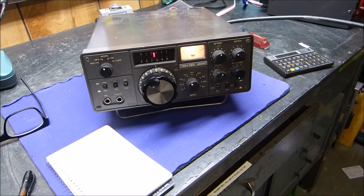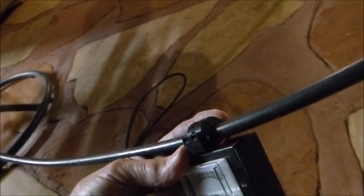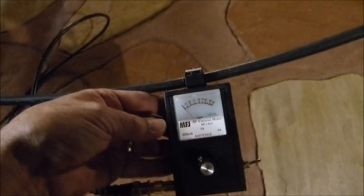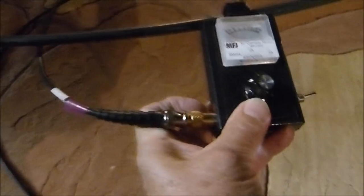I'm going to use this little Ten-Tec Argosy so I can generate just a little bit of RF. I've got some coax strung out here, marked off in meters. I purchased this little MFJ box — it's actually very simple. The hard part to get was this ferrite core that opens up. I went in and fixed it so that when this switches up into the red position, this meter is disconnected and I can plug it into my meter in the millivolt scale, and it works great.